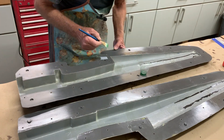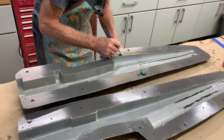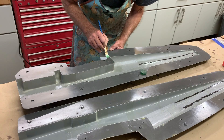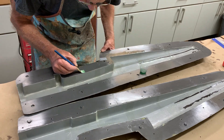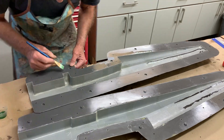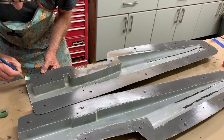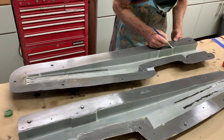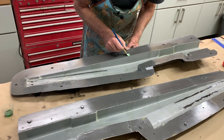Once we've got it all glued and clamped together, we're going to run some seam tape down the insides. One thing I do — I don't just go down the edge, I also come back about an inch to an inch and a half or thereabouts, so that when the glue runs, which it inevitably will, we hopefully capture most of it between the PVA — the mold release agent — which I'm putting on now. It stops the parting planes gluing together. It's not perfect, but it will do the job.